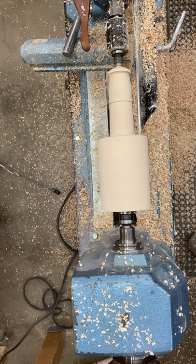Now you know why we do the taper with both the spindle gouge and the roughing gouge, okay? Because to try to do this taper with a roughing gouge, it's a much too big and aggressive tool, okay? We have to have a finer tool to be able to make this cut, okay? But you're gonna see when I do the head that I will use the roughing gouge to make this taper cut, okay? Because I have more room and I'm removing more material.